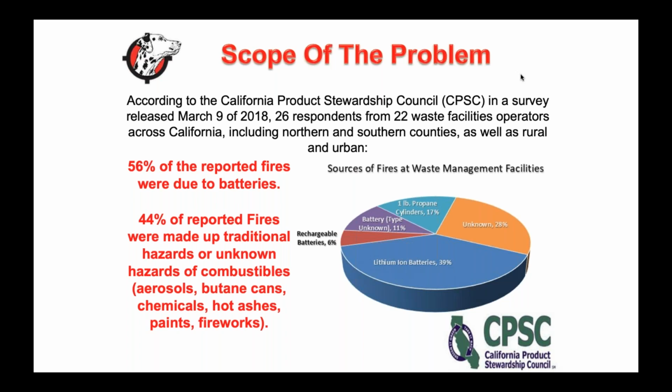I think one of my contacts will tell me that we literally create bombs in our curbside bins. We're not doing it deliberately, but we're using paint thinner and rags and other things, and throwing them into one of these Hefty bags. We close it as tight as possible and throw it in our curbside bin. It's 100 degrees outside, your bin becomes about 120, 130 degrees, and then it gets thrown into a garbage truck, which is putting pressure on it. If there's anything around it that can cause a spark, that thing will literally explode.